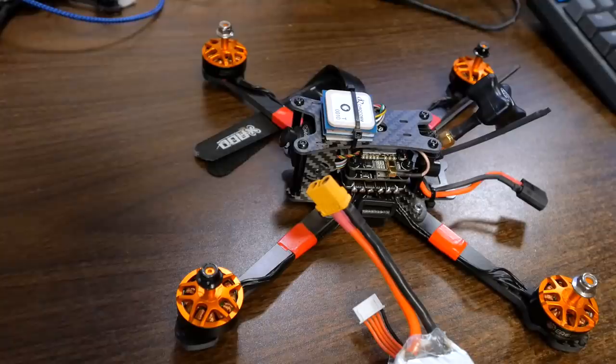This is a terrible place to do a compass calibration because we've got all the computers and electronics around. I have to do this again before I go fly. The OSD will show you 'compass calibration required' if needed. Compass calibration is really important — without the compass, the flight controller doesn't know which way it's facing and can't do most of the autonomy features. It can do acro flight mode without a compass, but it can't do a lot of the other flight modes.